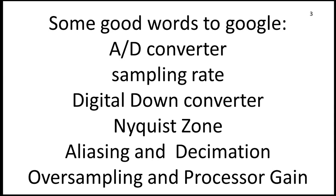Some aliases could be an advantage when manipulated mathematically in software. They're a mathematical duplicate of what you just sampled — not exactly like images, it takes a little study. Typically without some means of filtering near the antenna, direct sampling is a big barn door into the analog-to-digital converter. There's some of this stuff I might repeat just to drive it home.